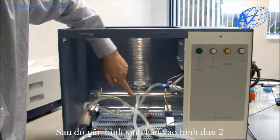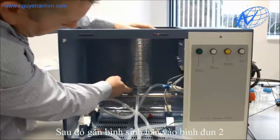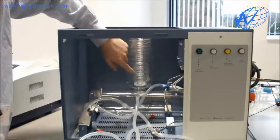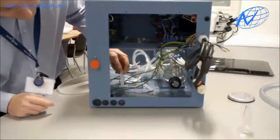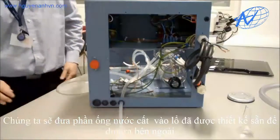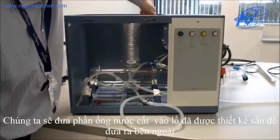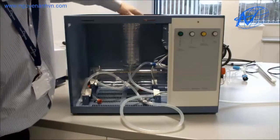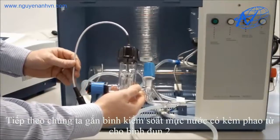The outlet should be facing forward. When you place it on top, you will feel a slight resistance. You should then push it down slightly so there's about three quarters of an inch gap between the condenser and the boiler. The sensor outlet hose is then fed through the rear of the small holes. The outlet should be facing the front, and the two other inlet and outlet connectors need to be parallel with the rear. Then connect the rear boiler water level sensor.